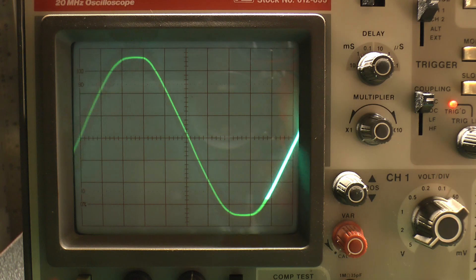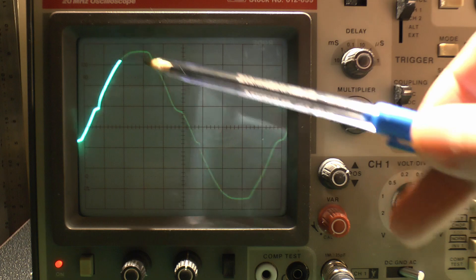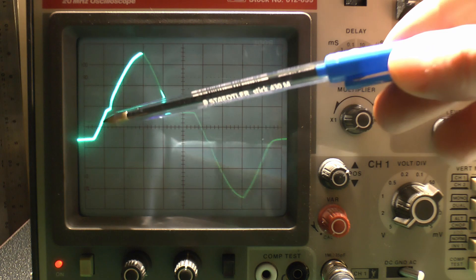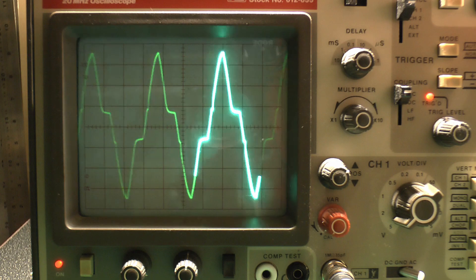I've now changed to a LED lamp — a dimmable one, 10 watts. At full brightness on the dimmer, it's almost a nice sine wave shape; there are a few bits of distortion but overall a quite reasonable shape. If we turn down the level of brightness, it's doing a similar thing — ramping up reasonably smoothly, and then the off period is at the trailing edge of the waveform. And if we expanded that, it's pretty much the same all the way across.